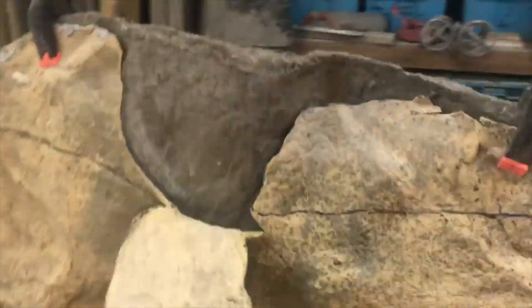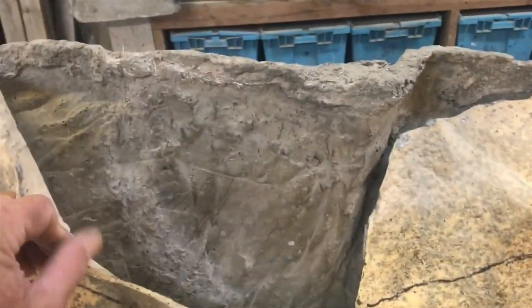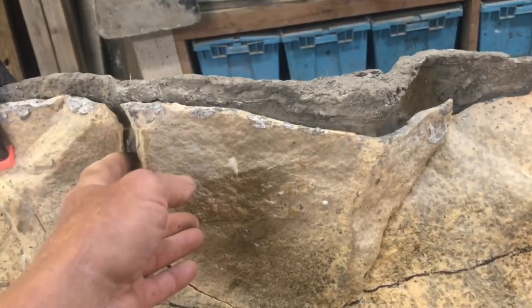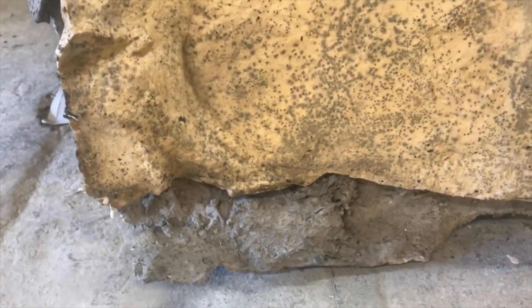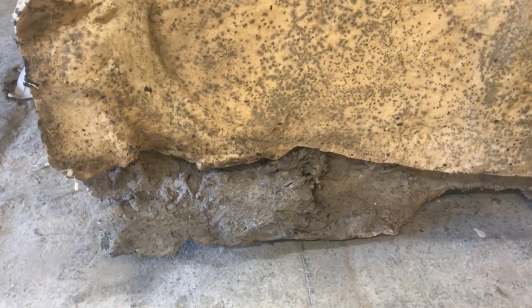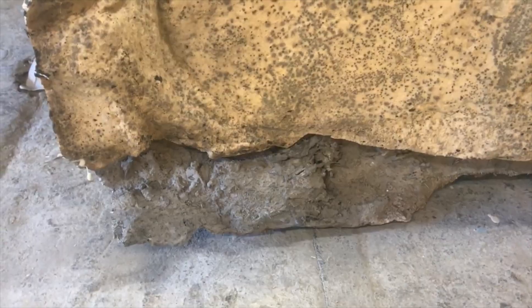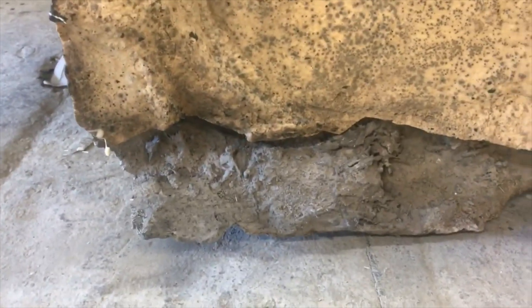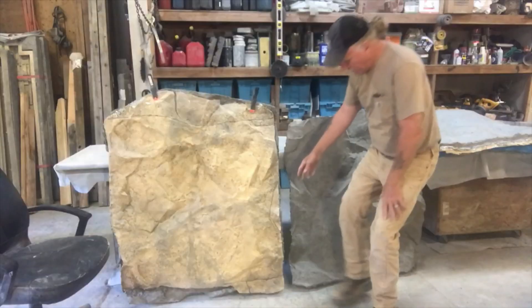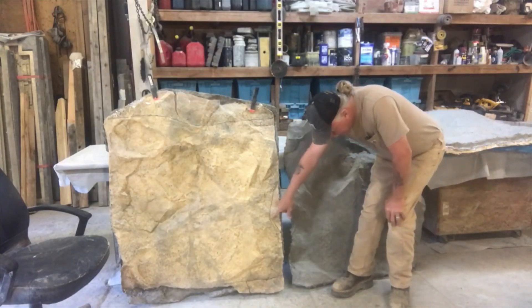When we cast, we usually put a piece of plastic in here. In the beginning we didn't, and that's why that image exists on there. You can see the mud has gone through the crack back to the hard mold, creating a defect. Where a piece is gone, mud stuck on the hard mold means the rubber won't lay as it once did — it's impeded by the buildup. There's a rip over here with the same issue.